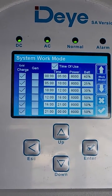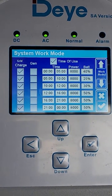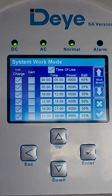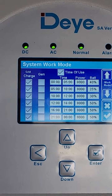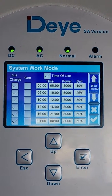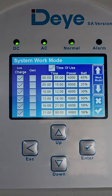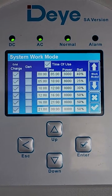Here are my settings — I've changed them a bit because it was cloudy this morning. I set my battery a bit lower; the 5-to-10 slot is now 25%, though I normally don't go below 30. I did that to avoid using the battery unnecessarily while waiting for solar to pick up. All slots are grid-charged but shouldn't use any grid — it's just backup. If there's really no solar, it'll go down to the first slot at 40% and the grid will maintain it there. Then the 9-to-12 slot is 50%, so it'll stabilize at 50 before going down to 40 in the early morning and then to 25.